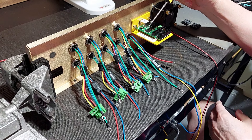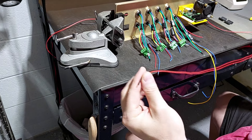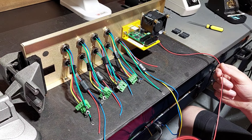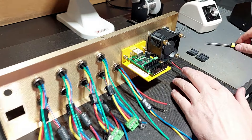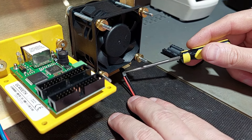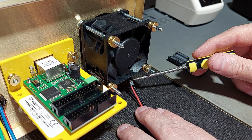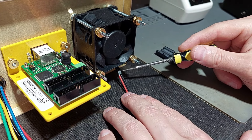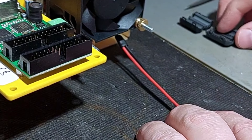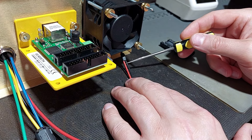A question that comes up a lot is about extending leads. I had to do it on a fan to get optimal neatness when wiring everything. I'm using silicone leads. To do this properly, you use single-wall heat shrink to insulate after soldering each lead — red and black. Once that's done using flux and solder, you put single-wall heat shrink on each lead and then go over it with a piece of double-wall adhesive heat shrink, which creates a thick polymer that adds strength to the leads.